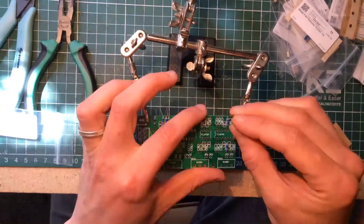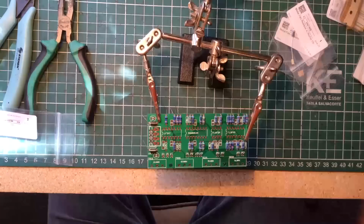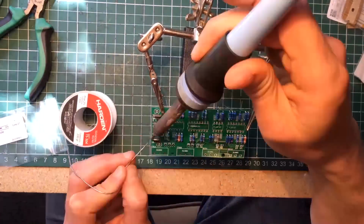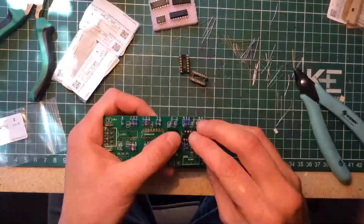The Barton Switched Resistor VCF is a very straightforward build. As usual, I started by placing and soldering all of the resistors from the top, then turning the board around and clipping the leads. Try to leave enough room for the 22 nanofarad caps.